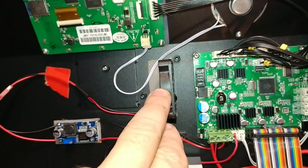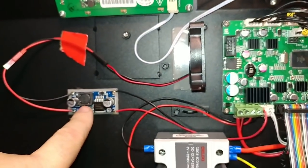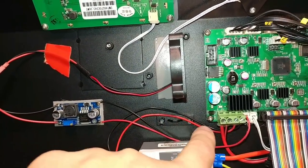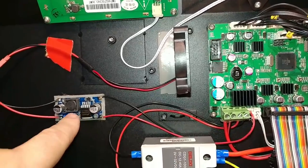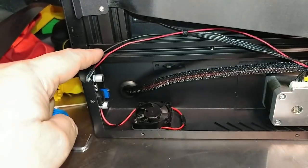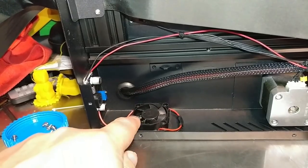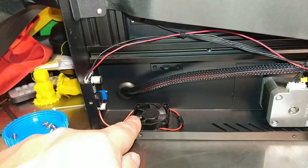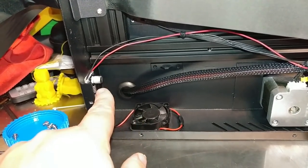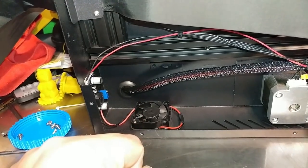Here's my setup for the cooling board fan: I used a 50x50x10mm Noiseblocker ultra quiet fan. Here's its 12-volt buck converter - it takes the standard fan output, converts from 24 to 12 volts, into the 12-volt fan. Same thing down here: 12 volts from the 24-volt power supply into this buck converter, adjusted for 12 volts, running to this fan. Turns out the 40x40 hot end fan will run at 12 volts and it's as quiet as an ultra quiet fan at 12 volts. I stuck that fan there for now while I'm waiting for another Noiseblocker to be delivered. I want to put one of those back there for higher throughput, but we'll see what the inside temperatures look like.